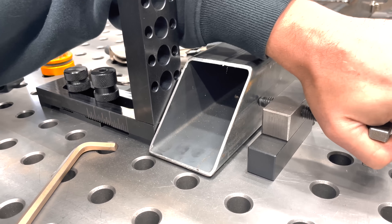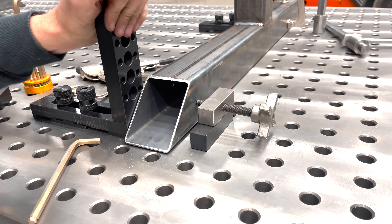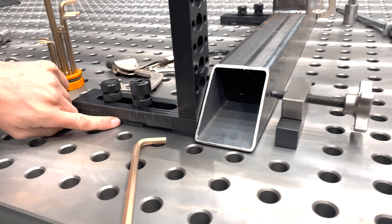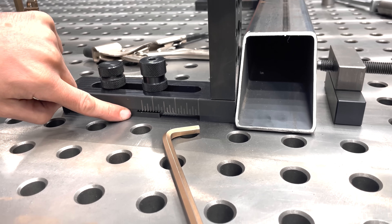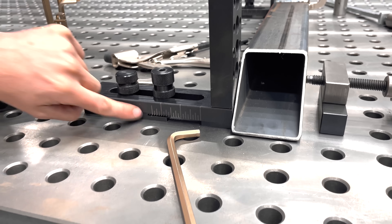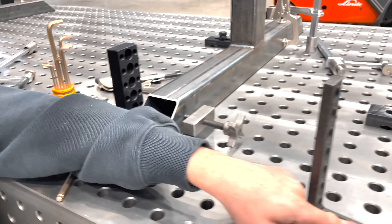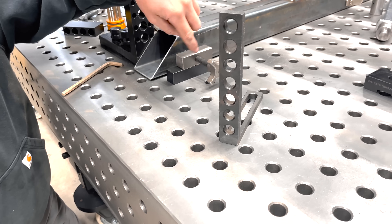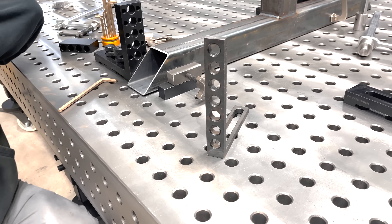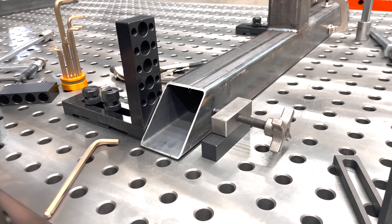We've come to a complete stop — I'm actually denting the tube. So that's why the plain slot, to me, is really bad. You have to have a tooth or some way to keep it locked in place. But if you only have slotted fixtures, please try to clamp using the fixture and not side push it. That will help you eliminate errors that could potentially come back and bite you later.